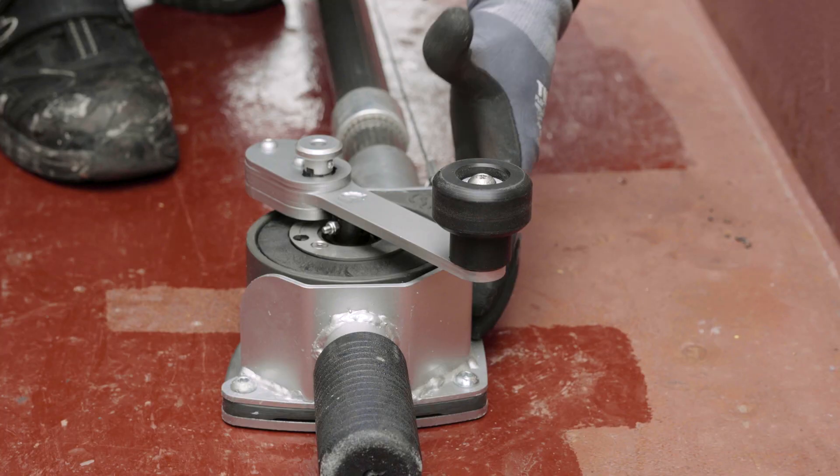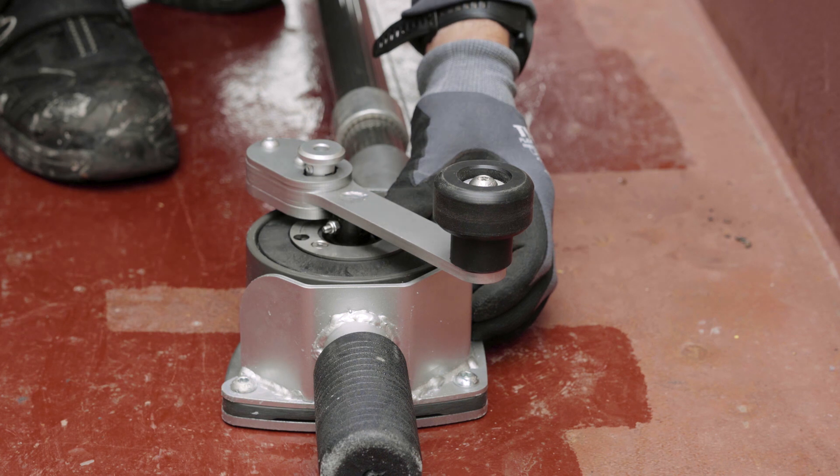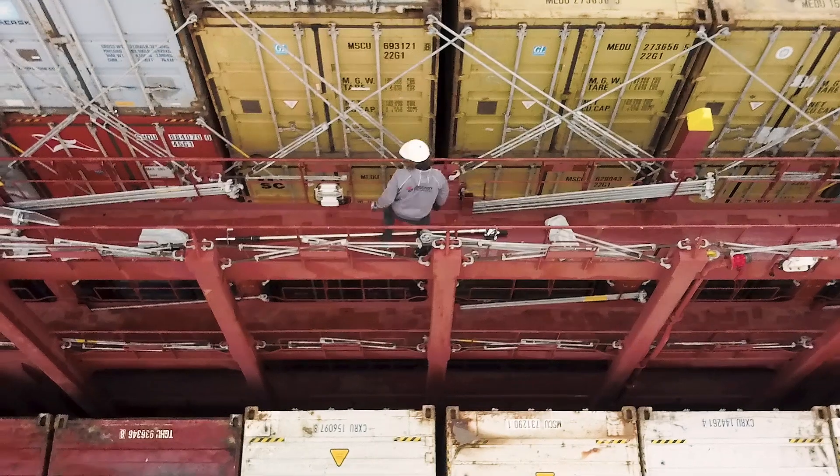Release the winch by manually blocking the winch drum with your thumb and engage the positioning bolt downwards. Turn the handle anti-clockwise until it clicks into the specified hole.